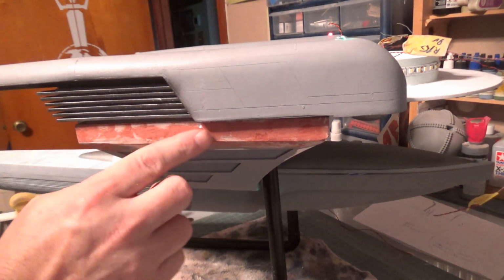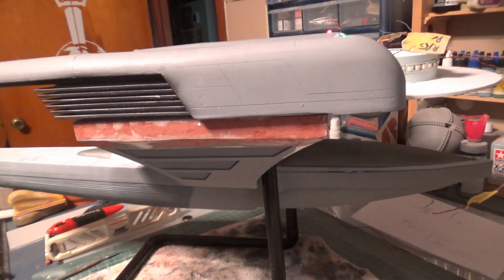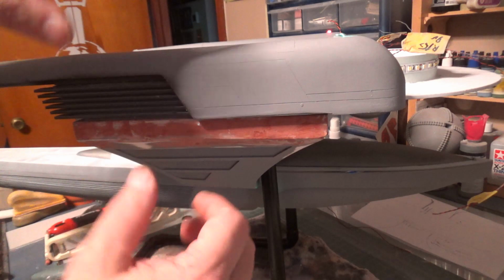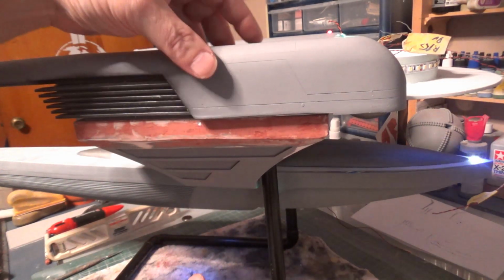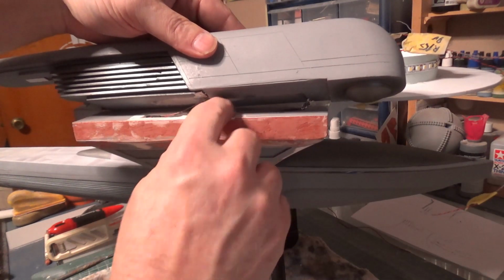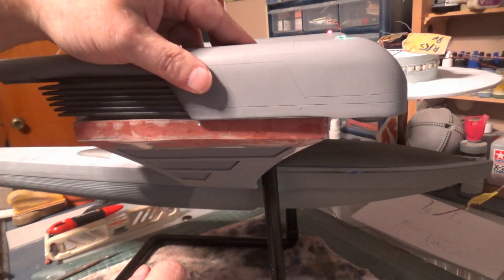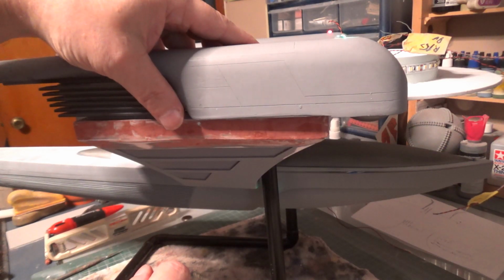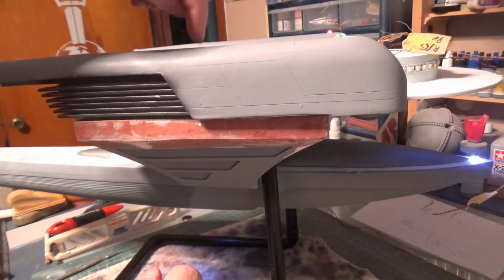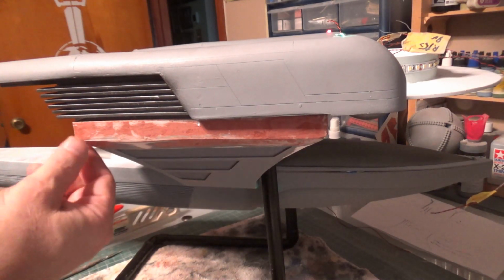I've got a high spot underneath there that I have done everything in my power to try to get rid of, and it seems to keep coming back. I thought maybe I was sitting on a resistor and pinching a wire. That is not the case. Everything has been well and truly channeled out here. So what I want to do now is do up the last batch of epoxy and then just sit this thing nice and level into that bed of epoxy and let it cure itself.